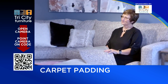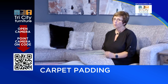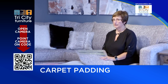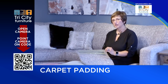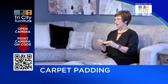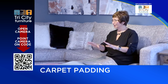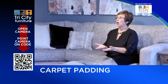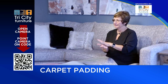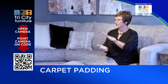So how do you know which pad to select? The important thing is to trust the store you're buying from, because they want you to have quality in your carpet. The pad underneath is really important. If you don't have good density in the pad, it will actually allow the backing of the carpet to stretch when you have a piece of furniture on it, and you get rippling. The foam pad is designed to hold the carpet backing, still allow for cushioning when you walk on it, but it won't break down the backing or the face yarns.